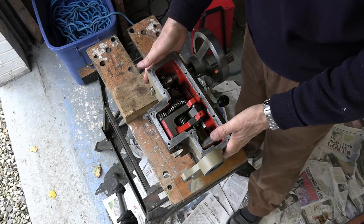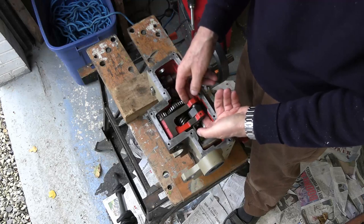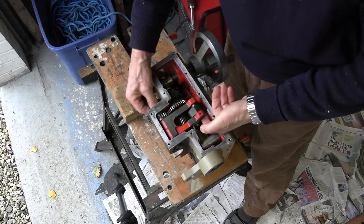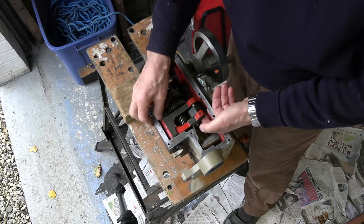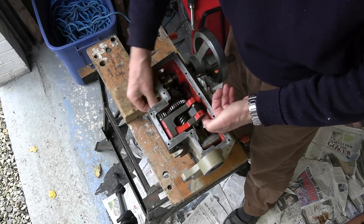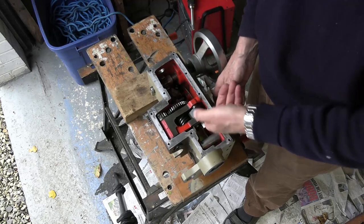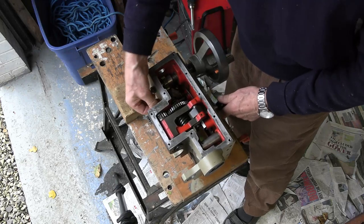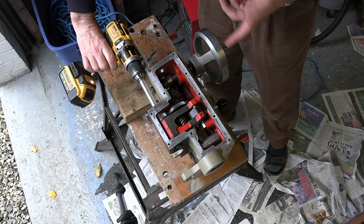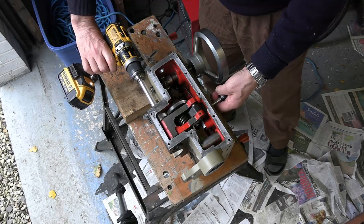Here's the apron but it is upside down, so this is the bottom of it. This assembly here is normally held in that position under gravity. We have a slotted rod that comes from the feed gearbox which applies feed and operates this gear, which operates that gear, and operates that gear. But because it's not engaged with anything, nothing happens. If we allow it to engage by operating this lever, then - applying a little power to this power feed - it starts driving the apron and the saddle along the ways. That's disengaged, that's engaged.